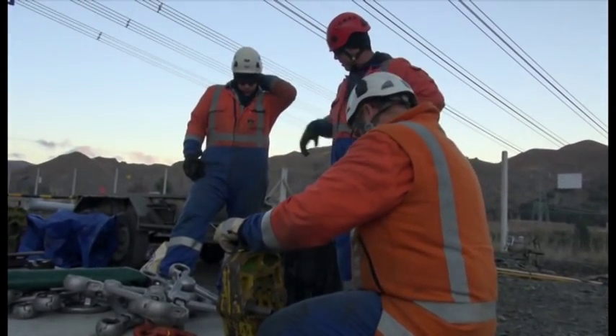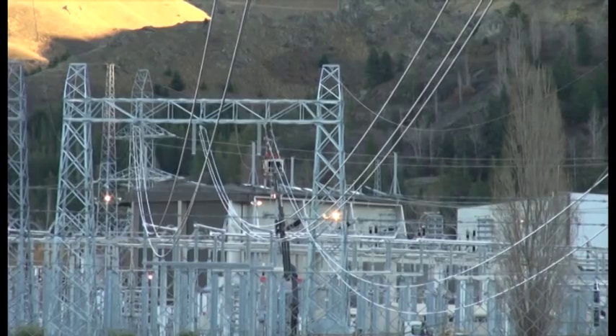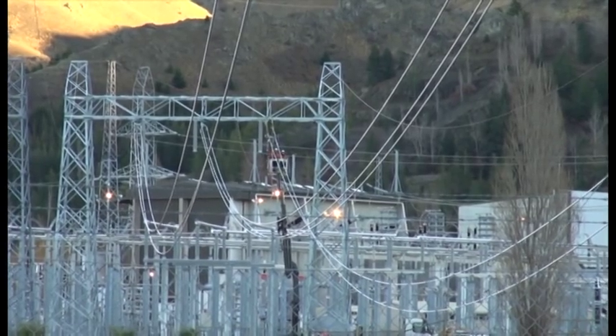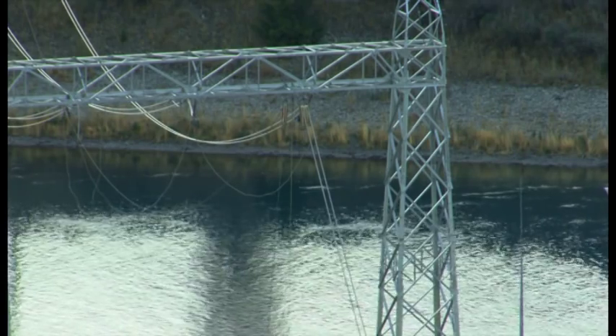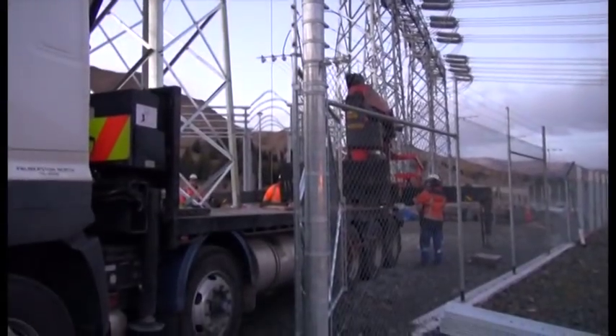That's the final nine wires all up today. What happens is that over the other side they release the 5-8 and the nylon rope off the cobra, then we'll pull back the 5-8 wire rope. We'll pull these two wires that are up here already up to 90 percent sag, cut the one on this side, dead end it, then send it through again — that's the third one coming through — then sag and dead end all of them and we're away out of here to find better weather.